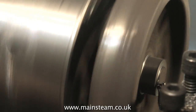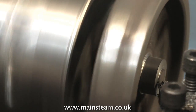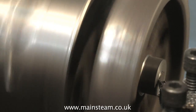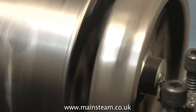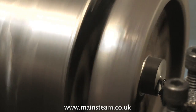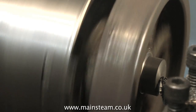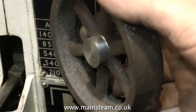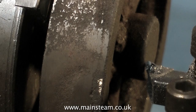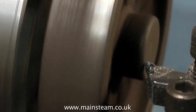The other major problem with castings are sand blowholes. So you start machining your beautiful casting and a little black spot appears, and the more you machine, the more the black spot gets bigger and bigger. And you see a network of holes in the casting full of sand. The really annoying thing about it is you may already have machined some of the casting before the problem comes to light. Like this one — the main boss has done okay, but I'm about to have problems on the outer edge. This is a really bad casting — look at the state of it, look at the lumps on the spokes, and they are really hard. I did try with the needle file but got nowhere. Great for this demonstration though.